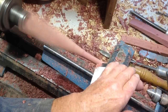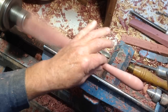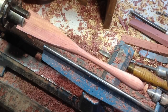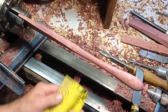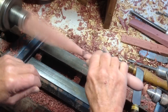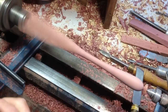Now this hand comes in rather like a movable tail centre — just a little bump there. I used to put a bead in around here but I prefer the planar shapes, much nicer to use and wash up. I think that'll be fine, so that now needs to be sanded — starting with 180 grit. I only have my hand over the top and just squeeze the abrasive around the wood. Pretty good cut so it doesn't need too much attention.